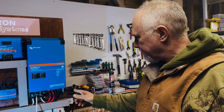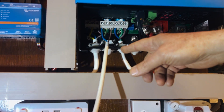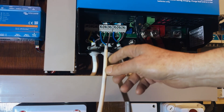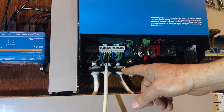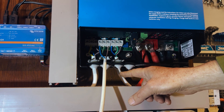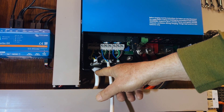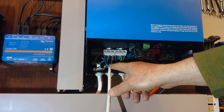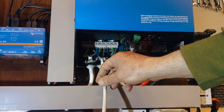I'm going to take you through the various steps. First thing I'm going to show you is on the MultiPlus itself — I've just attached this wire. As you can see, the middle wire here is your AC Out 2. The one on the right is your AC In, that's coming in from shore power or from your grid. This one here is the AC Out 1, and this is where we've taken this to our plugs here and we're running loads of things off here. The AC Out 2 is like an alternative one, and I'm going to show you how we've used this now.